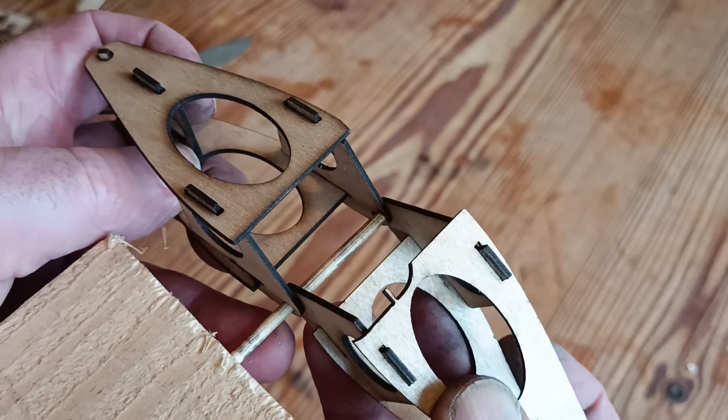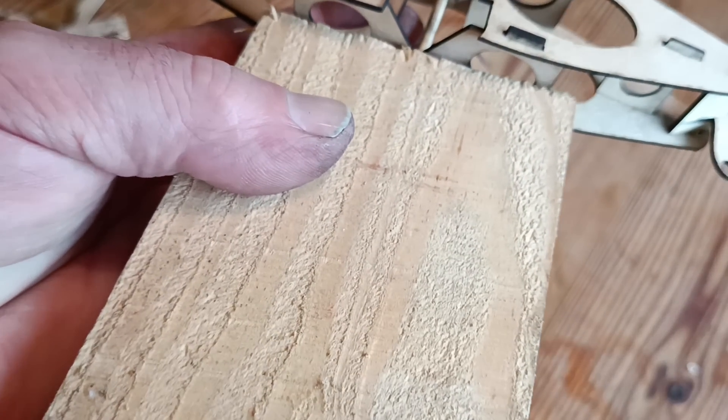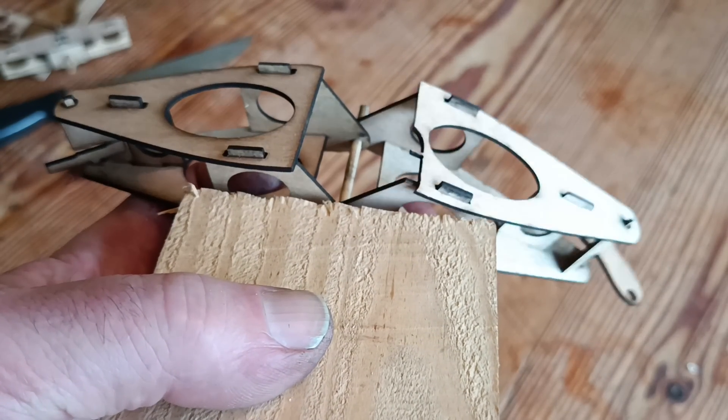With only one hinge like this, the wheels will be flapping about like wings. But perhaps we can improve on that by taking the hinge as far as possible from the wheel — in other words, by making the horizontal plate as long as possible. The wheel would still tilt over, but by much less. So in my next model I did just that: I extended the hinge plates all the way back to the center where they can meet.